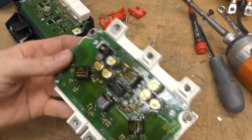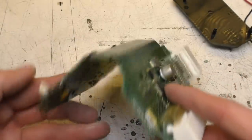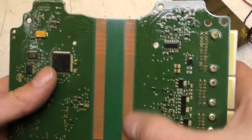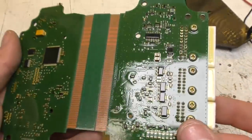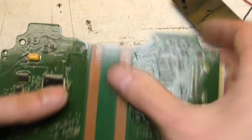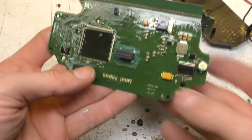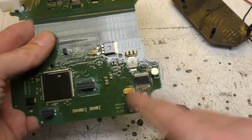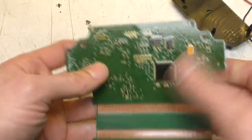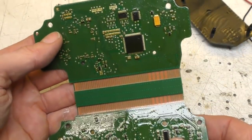This actually unplugs — we've got a board that is all conformal coated. This is the control assembly on a flex rigid PCB, which just folds up so you can get lots of internal connections without needing a connector. There's an Infineon Tricore main processor here, a power supply chip — a switching regulator that provides loads of supply rails — and an Actel ProASIC CPLD which is probably providing some of the low-level waveform generation.